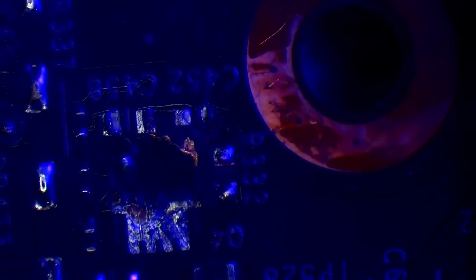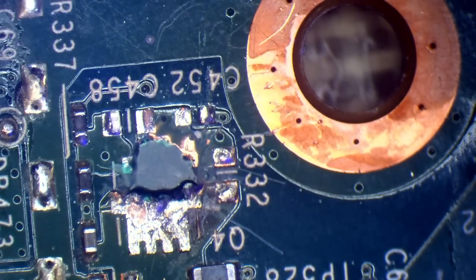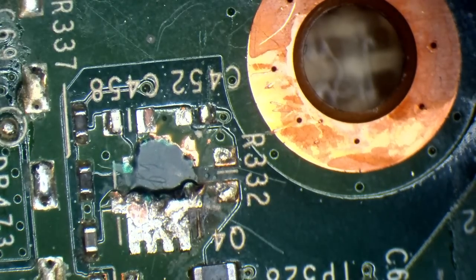I'm going to put some UV light on here. This will not hurt your eyes. You can kind of see this going hard already. These UV lights are really strong — I'll be stocking them on the website in a couple of weeks. One thing you can do to speed up the process is add a little bit of heat. That should be absolutely rock solid and nicely protected now. Nothing's going to get through that, and now I can start to rebuild this circuit.